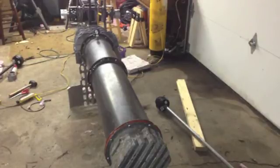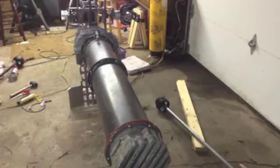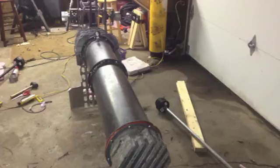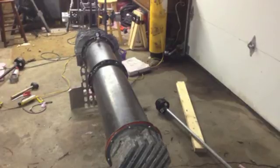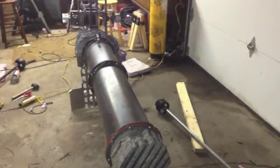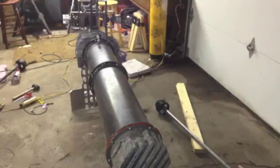One of the big benefits of moving away from the fins and the aluminum displacer is the elimination of about 20 pounds of aluminum and probably about six hours of machining time. So it shaves off a significant amount of cost from the displacer construction — both cost and time — which is a plus.